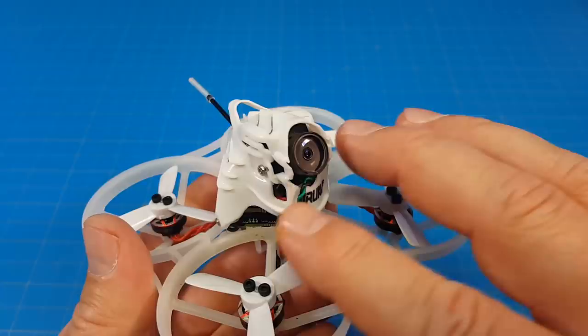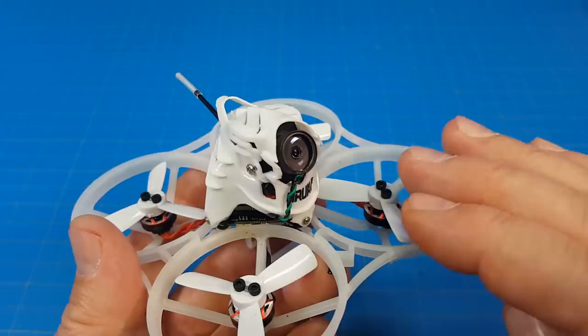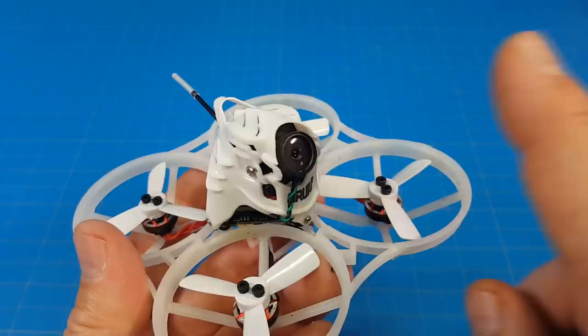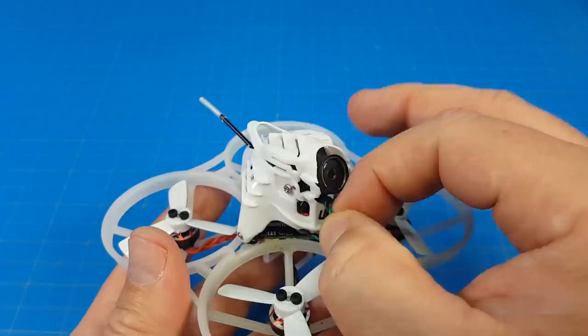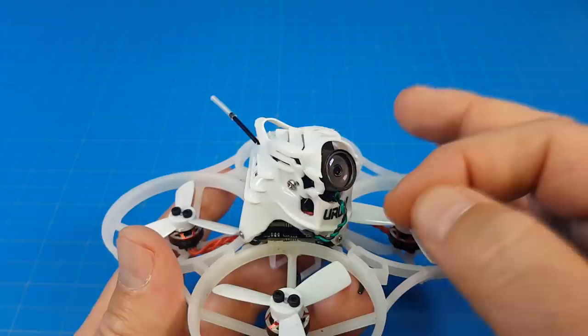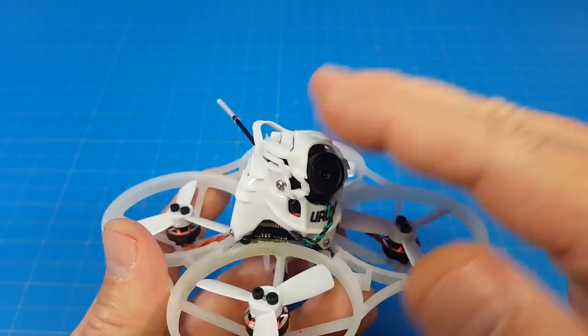In the quick roll I mentioned it comes with the control board so you can manipulate the camera. In my footage I did update the firmware to the January 24th firmware — I'll link that in the video description. I found that's the one I'm able to flash to the board that gives me the best results and doesn't have lines that appear — typically horizontal lines in the corners of the screen all over the place. This little wire that they've got tucked away in there actually stays in there pretty well. It's kind of unsightly to see it hanging out in front, and it might give you some trepidation about things getting in the way of the props and getting chopped off, but it does take quite a bit to wiggle it in and out of there.